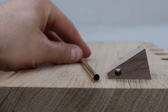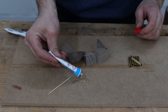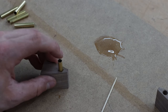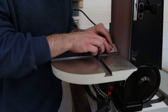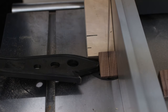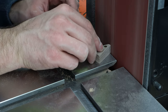In order to inlay the six millimeter brass pipe into each hole, I set the fence of my bandsaw a little wider than the key chains and cut the pipe to pieces. After that I mixed up some epoxy. With a toothpick I applied the epoxy to the inside of the holes in the key chains and inserted the brass pipes. I cleaned out the epoxy that gathered inside the pipes and let it dry. Since the tubes were a little oversized on purpose, I sanded them flush — at that point I was really in love with this project. Then I resawed every walnut triangle into two pieces, 12.5 millimeters each. A bit more sanding and rounding over the edges gave the key chains their final shape.